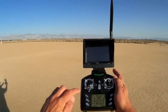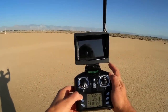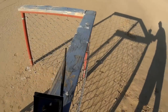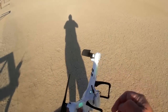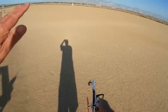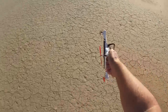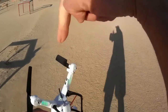Now we want to calibrate the x-axis gyro. To do that, we hold down this button — and the y-axis gyro is calibrated by pressing down the other button — hold it down for a few seconds until you hear a beep. We're going to start with the x-axis gyro. It's ready for calibration. You can see it's ready because if you pick up the quadcopter, you'll notice the lights are flashing, especially that green light. For the x-axis, we've got to spin it around the longitudinal axis: hold the quadcopter out at arm's length, point that lens directly vertical, and rotate your body until it stops blinking. It may take several rotations. And there we go — the x-axis has been calibrated.